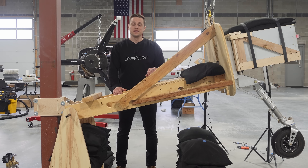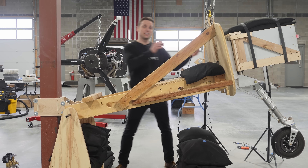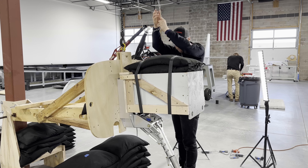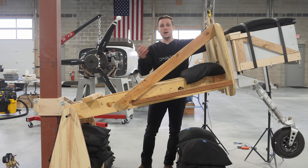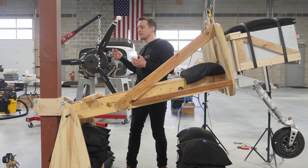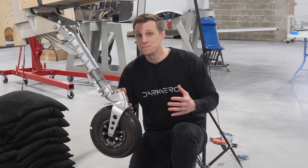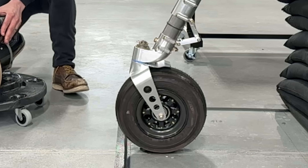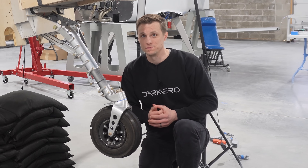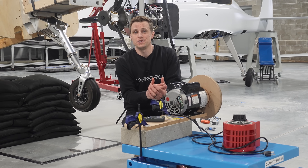Let's look at the test rig. It allows us to drop the gear in a controlled manner by pivoting it at the back end and allowing the end with the gear to swing to the ground. We can raise and lower the stand to the desired height using this hoist. With this engine box, we can add sandbags until we get the full weight needed. Using this weighted box over the actual engine also means we can avoid damaging the engine in case something were to go wrong. We opted for this approach over a pure vertical drop test stand because it was easier and quicker to set up. A small but notable part of this setup is this rubber slip fit ring — as the shock compresses, the upper trunnions will push on the rubber ring and slide it down the strut tube, allowing us to measure the total shock compression.